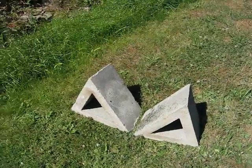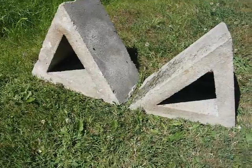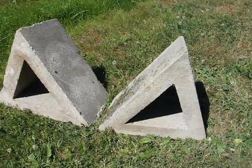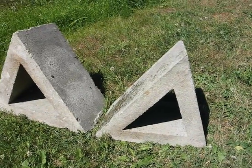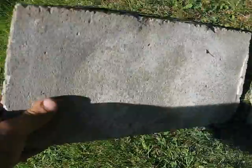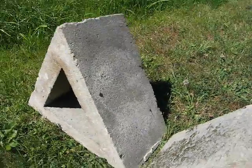I'm taking a moment today to try and explain the evolution of this masonry system. These are the first generation of triangular masonry blocks that I produced. They are mass produced on a concrete block machine — these were made on a Columbia, three at a time. You can see the slight taper or draft to the shape. These will assemble into a sphere or any part of a sphere, such as a dome.